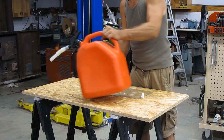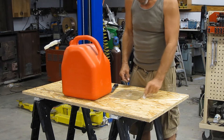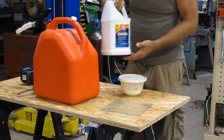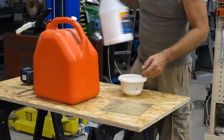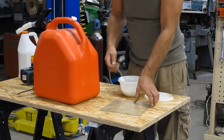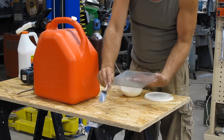The only thing that I've found that sticks nylon is PVA glue, which is Elmer's 50-50 on glass. I paint it on with a sponge brush, let it dry, and print away. This is basically what I use — it's watered down 50-50, kept in a little Tupperware container with a little sponge brush in there. It's basically Elmer's glue watered down.